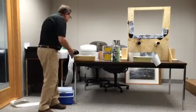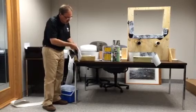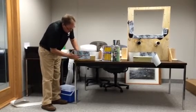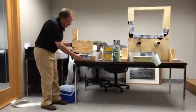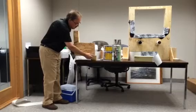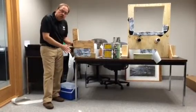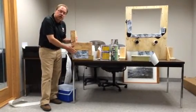This material, what we're doing is we're taking, very similar to the sill pan flashing in the window, we're putting it the entire length of your foundation area. See how that goes up against? Then I bring my wall, or I bring my subfloor. I put it in this application, and then I release at this point my liner, and I come up. I keep insects out, rodents, water, air infiltration, versus what's on the market today. It's a much better product.